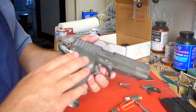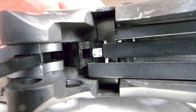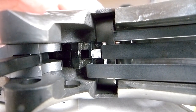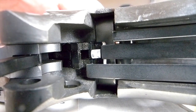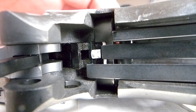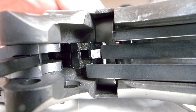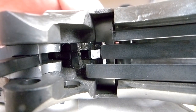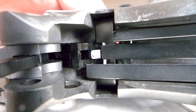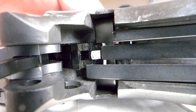I hope that makes sense. Let me take this apart so we can take a look at that and make the adjustment. Now if I pull the trigger, you'll see it'll push on the disconnector and the sear moves, and that center spring is pushing against that angled portion of the disconnector. See that trigger bow moving a little bit there? It's bumping into this assembly, which is dropping the hammer. So if I increase - just bend that center spring of the hammer - hopefully it will prevent this from happening.